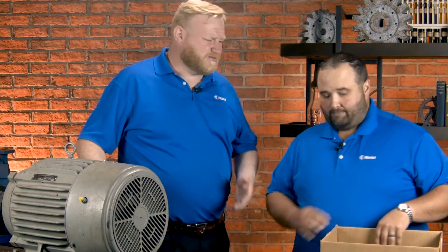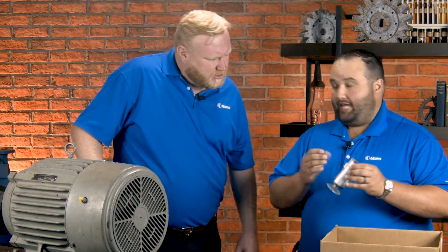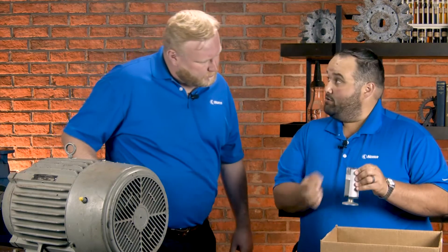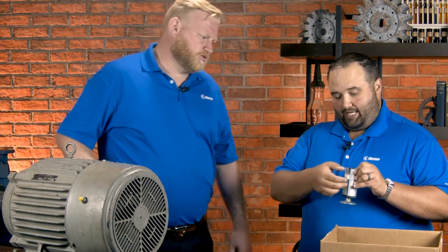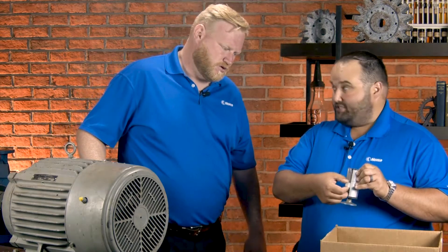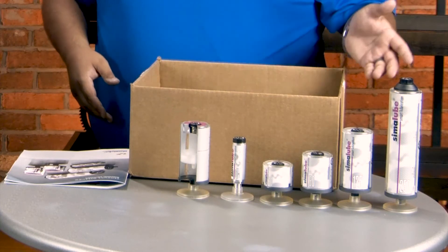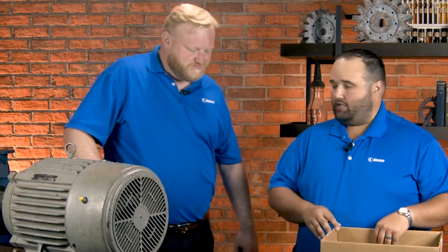Sure, a lot of different areas and a lot of different ranges. With these guys specifically — single point lubricators — we typically look at a couple different types. I believe with these specifically they're electrochemical, right? They are electrochemical. These are the ones that — it's not a positive displacement pump with an electric motor — but as you turn the dial, these two will look like watch batteries exposed to each other, and it basically produces a gas. As that gas pressurizes, it pushes this piston down, which in turn pushes the grease out the bottom. So lower numbers mean running fairly higher pressure early on, distributing more grease. Moving the number up to 12 — 12 months or so — we're looking at longer life out of the greaser, lower pressure and such like that.